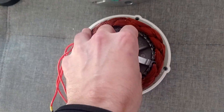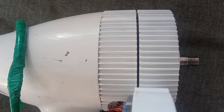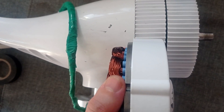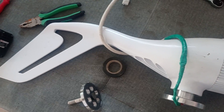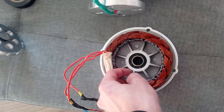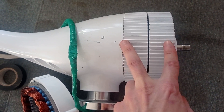In contrast, this is something different here. Those generators are combined from two halves - this one was actually mounted so all this piece was going inside. I found out on AliExpress, where I was buying this turbine, the whole thing cost me around 100 bucks. In reality it was only able to produce something around 34 watts at its peak, because there is just not enough metal to actually produce more.